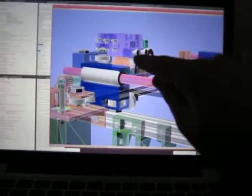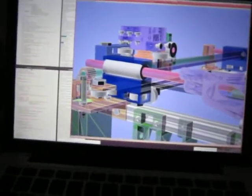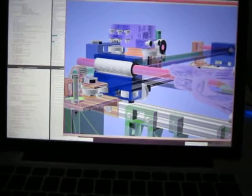So in other designs, that bearing obviously is on the other side because this is much larger and the rod is in the middle and the carriage is over there a little bit and it's offset in the center, and the printer's another whopping 100 millimeters larger. This is a 312 millimeter width and a 358 length. It's not 400, 450 like most printed designs. So I had to stack things upwards, which has meant that I have height limits on the box and stuff to meet, which I've just managed to get.